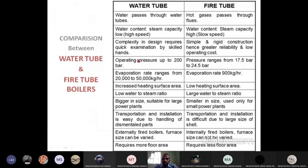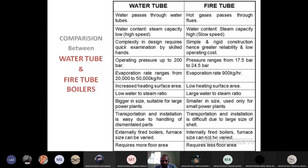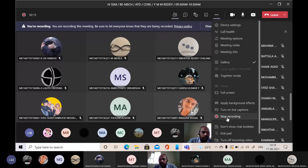The superheater converts dry saturated steam into superheated steam. The anti-priming pipe separates water from steam — only dry steam is fed to the superheater. By using the steam stop valve we can make use of the steam. This completes the Stirling bent tube boiler. Total we have three fire tube boilers and two water tube boilers. Next we will discuss high pressure boilers.